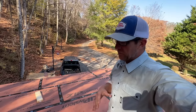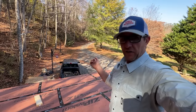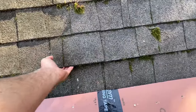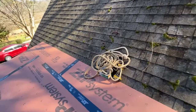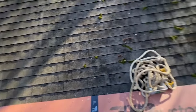Shingles, that's it. Now, obviously I gotta do another piece of final fascia on the outside, and I gotta do some drip edge, and then I gotta figure out what's going on here. Obviously I need to get some flashing that's probably gonna roll up under this layer of shingles right here, up to there, and then put the shingles up there. Again, I gotta probably talk to the boss, JMO, to see what I should do exactly there, just to make sure nothing's leaking. But that's fantastic.